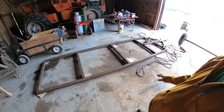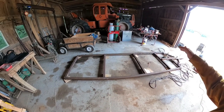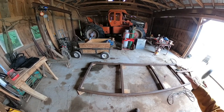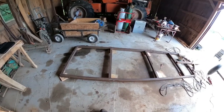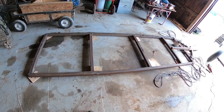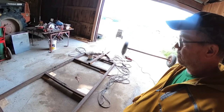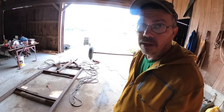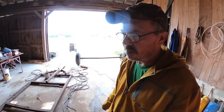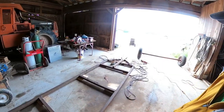When you put the axles in the center, you don't have any tongue weight. And if you don't have any tongue weight, that thing just sits there and rattles and jitters, and it causes a lot of problems going down the road. It can be very dangerous. I took that trailer out of service very shortly after I bought it, because I was afraid it was going to pop off the tongue of the truck going 50 miles an hour, and that could be a disaster. So I've already harvested the axles out of it. I'm in the process of cutting the steel out of it now and using the treated wood that was used on the decking.